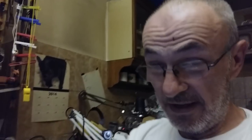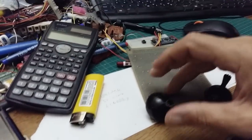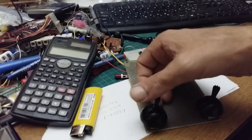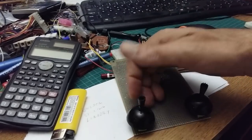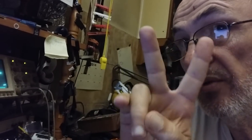And this is why I like this chip. Because for my weird boat, I need a remote controller. Since I destroyed one, I'm just using potentiometers, which will serve for, I don't know, the camera and for running both motors, with differential steering left and right. And we'll see what else. PWM, I will need it for motors. And you can see how simple it is. You just need to put two programs, one for the transmitter, one for the receiver.